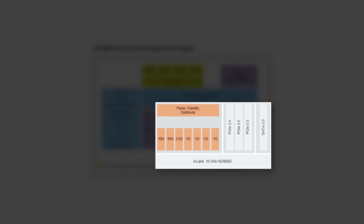Apart from the decreased number of lines, there's also another benefit to using SERDES, and that's the versatility it brings to the table. As you'll shortly see in more detail, above the SERDES block there are three different possible signal types that it supports: PCI Express, various ethernet interfaces, and finally SATA. Because of this, the block diagram can be a bit misleading — it's not possible to have three PCIe version 3 lanes at the same time, and the same goes for the ethernet interfaces. It's not possible to have both two 10 gigabit interfaces and a 2.5 gigabit one at the same time.